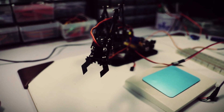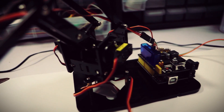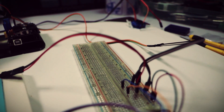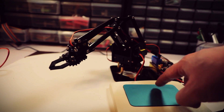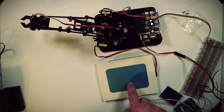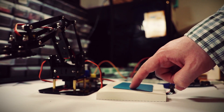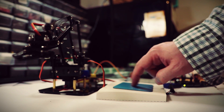The reason I'm using a servo is to see if I can control a robotic arm's movement using the touchpad. Unfortunately, this robotic arm has four servos, but since the touchpad only has an X and Y axis, I'm limited to controlling two servos — so I went with the rotation and finger servos. The final test worked, but it wasn't quite what I expected: it moved both servos at the same time because it was impossible to move my finger in a perfectly straight line to affect only one axis. This could be fixed in code by requiring each axis value to exceed a threshold larger than 1, but it can be debugged later. The concept worked, and we can now use touchpads to control the world.